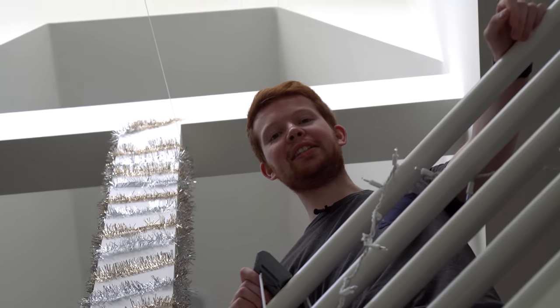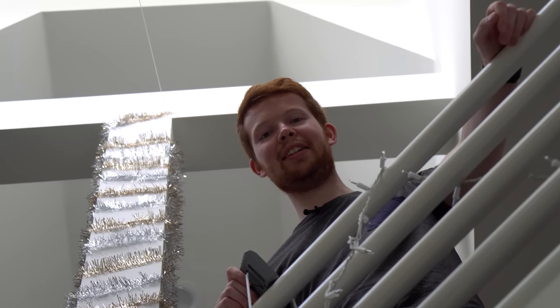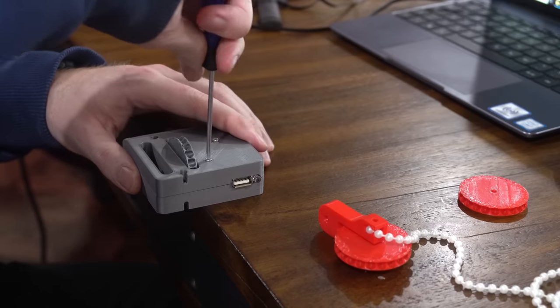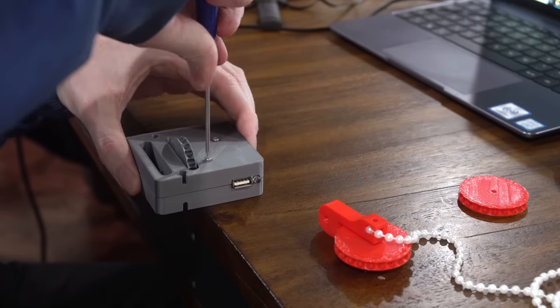We need to make this thing lower slower — more weight in a pulley system to pull it slower. In order to slow the descent rate, I've added two extra pulleys, meaning the weight will descend three times slower for the same RPM of the generator.